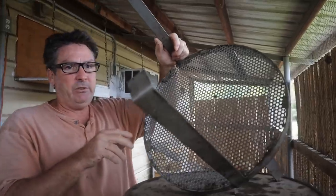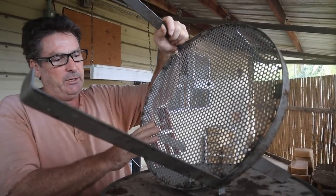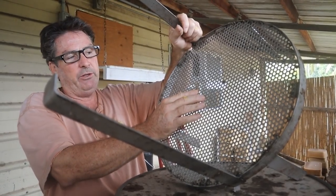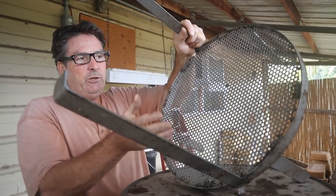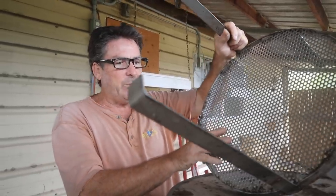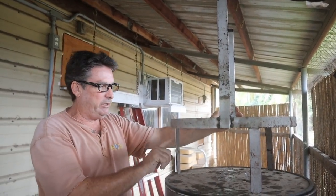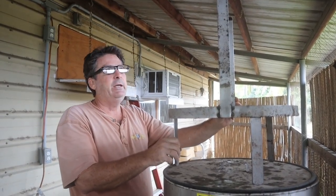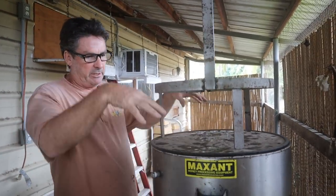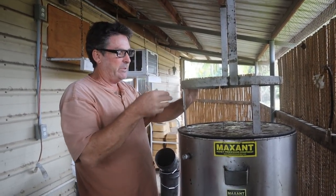Here's the little wax screen device I made. I watched the video, saw the idea, and adapted it to what I do. I made it all out of stainless — you don't have to do that, but I like it; it's not going to rust and it should last many lifetimes. This is just a perforated stainless sheet with quarter-inch holes on three-eighths-of-an-inch centers. The frame is inch-and-a-quarter, eighth-inch stainless steel and the legs are one-inch, eighth-inch stainless. I had a little ring roller and made a ring. It's important that it fits snugly down the side so the slum gum doesn't come up and around the device.